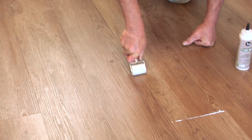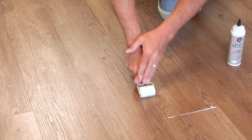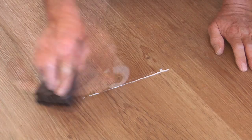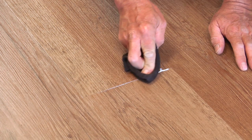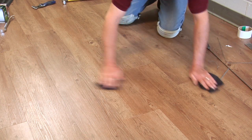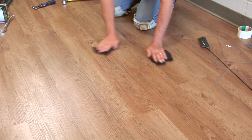Rotate down, locking the long tongue joint, and roll the compression end joint to lock into place with a small hand roller. Wipe any excess sealer that comes to the surface of the tiles with a damp cloth and follow with a dry cloth to assure all sealer is removed from tile surface. Keep foot traffic off the replaced plank or tile for 24 hours.